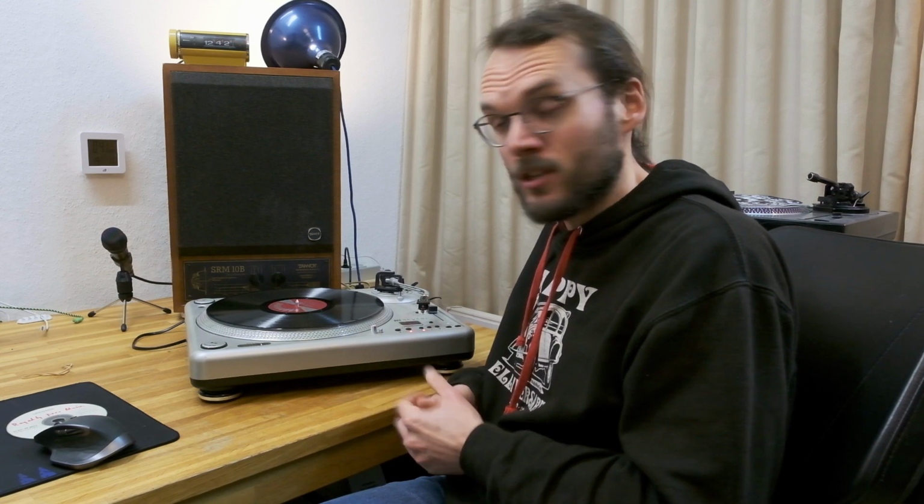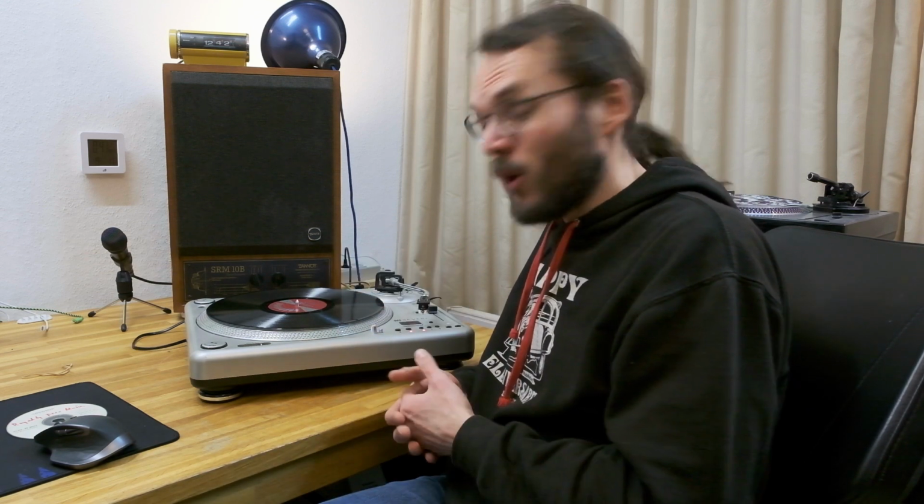And you want to make sure you get it right. And if your sound sounds like crap, you probably have some mismatching components. So either you have two preamplifiers hooked up to each other, loads of distortion, or you don't have a phono preamplifier or a phono input, and you have an old-fashioned record player that doesn't have one, then you need to buy a separate phono preamplifier.